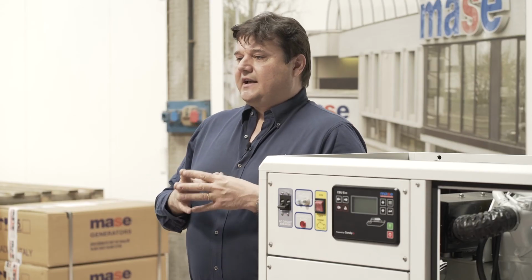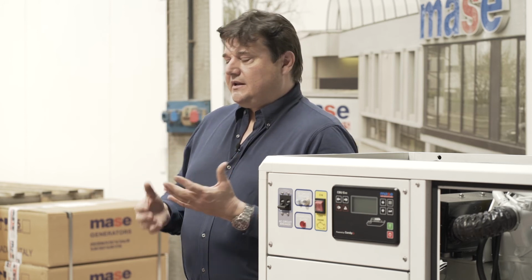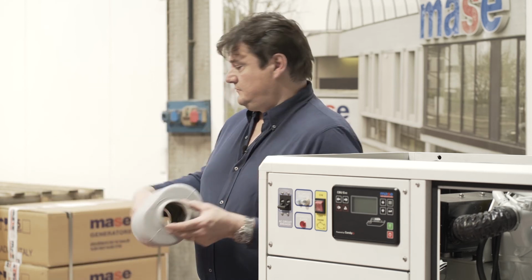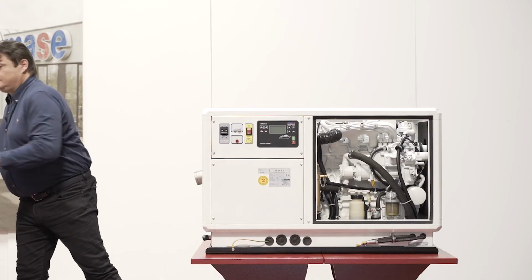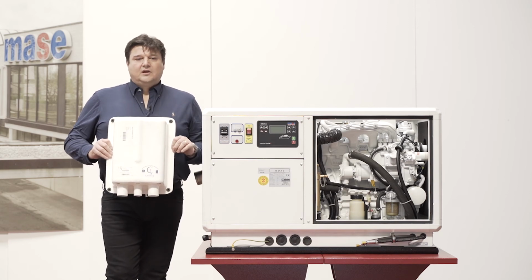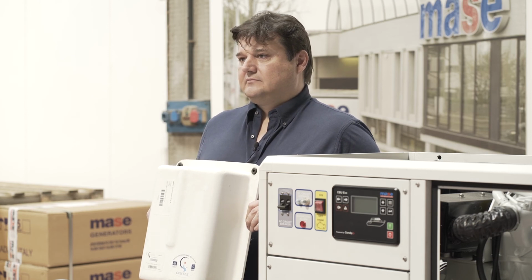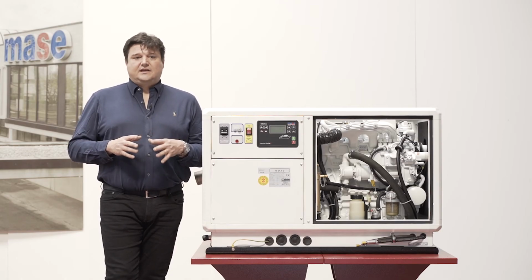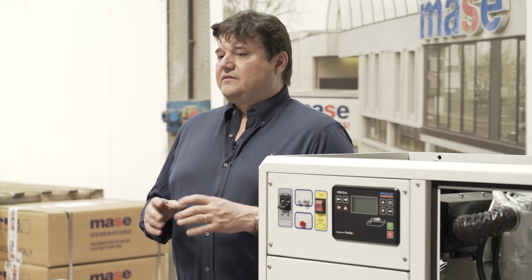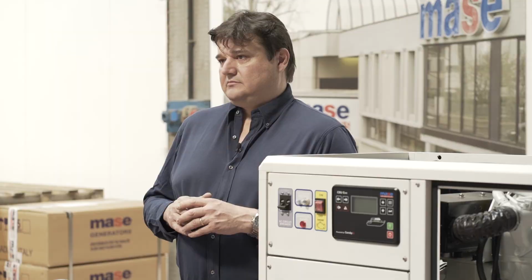At this point, we can discharge on that side with a descending exhaust line and with an eventual inline silencer. Or use a water-air separator and then discharge the fumes on the side and the water in the hull. It is important that the exhaust pipes are not fixed to structures because when the unit is switched on, they generate strong vibrations, and these vibrations could propagate along the structure of the boat, turning into noise.